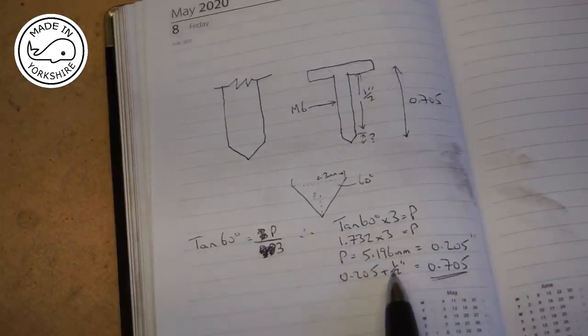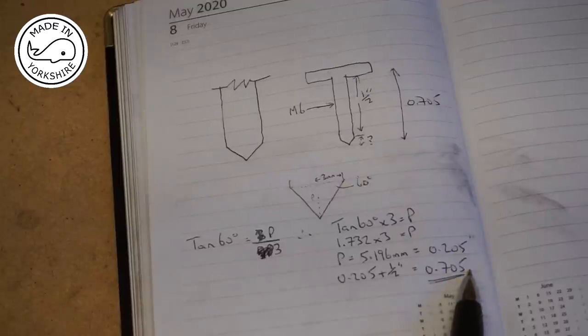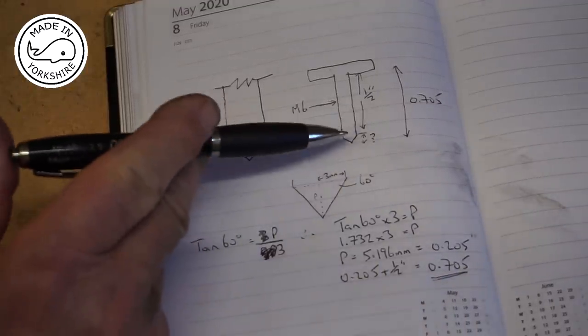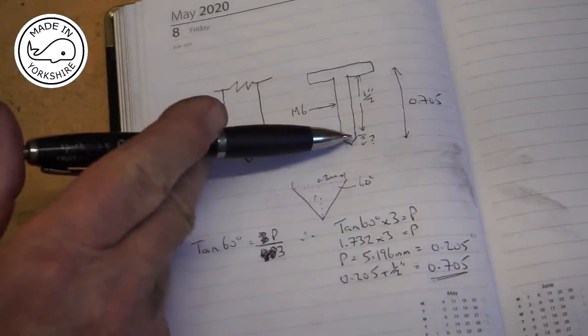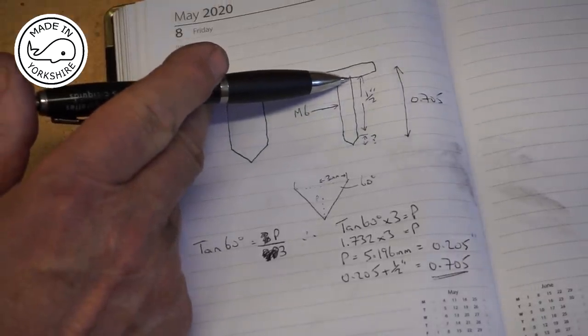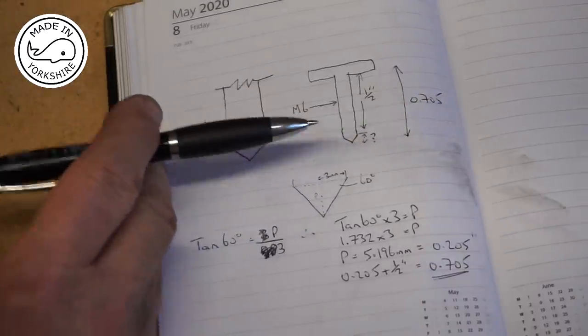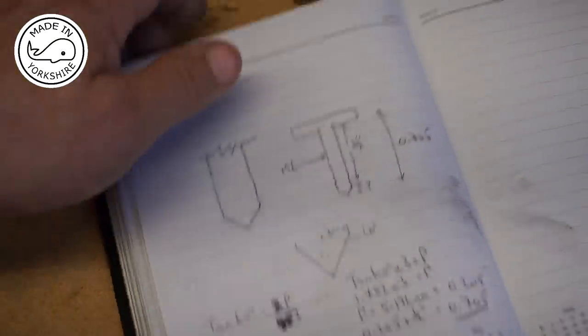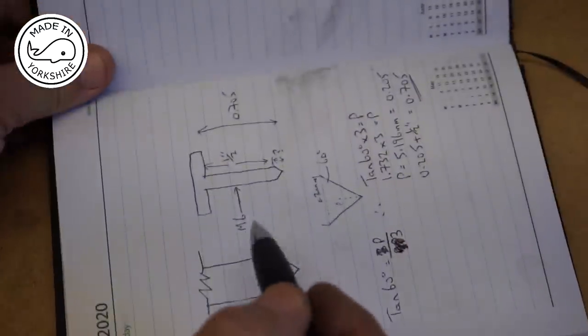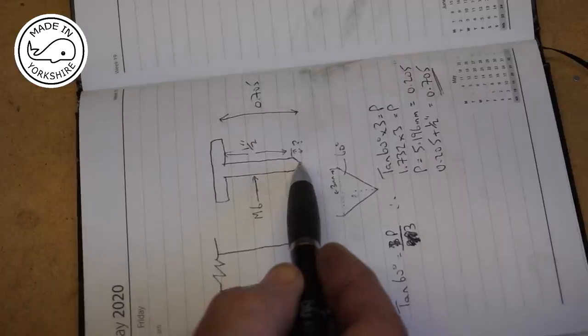Now, if I add 1/2 inch onto that, I get 0.705. So the distance between the point and where the thread is going to stop is 0.705. So on the lathe, what I can do is I can set my tool bit there,